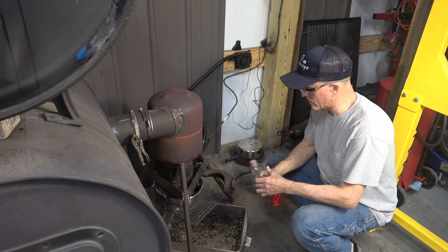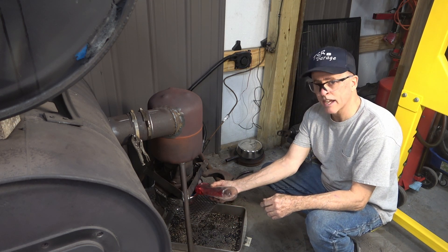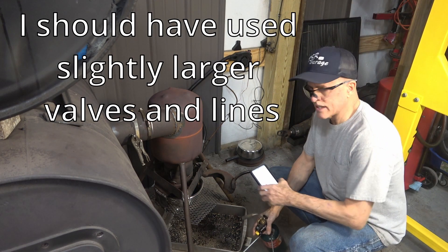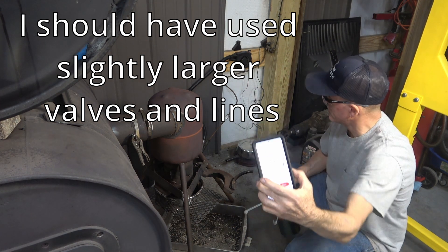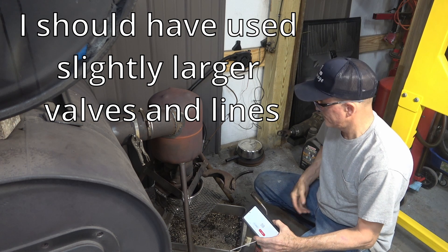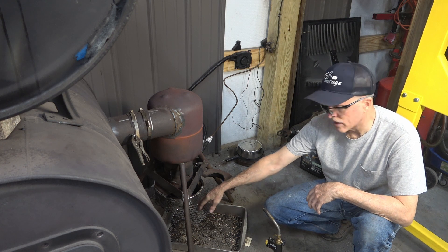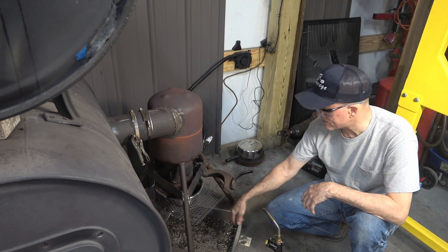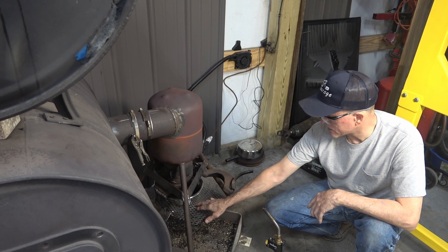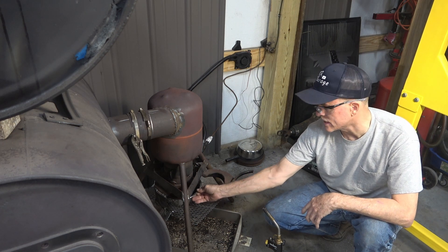Drop in a little piece of towel or a rag, put some kerosene in it — not gasoline. Gasoline explodes; kerosene burns. It takes almost two minutes for that oil when it's cold to get down this tube and start flowing. This grate on the bottom will allow any drips to just fall through to the pan and not create a whole lot of smoke, hopefully. It'll also give me the opportunity to put bolts through here or stoppers on whatever kind of pan I decide to use.